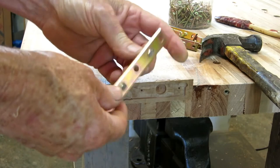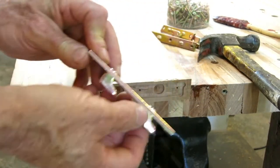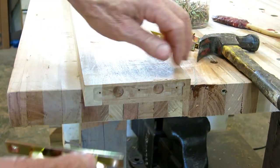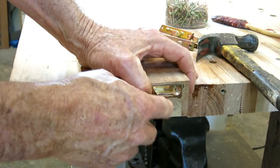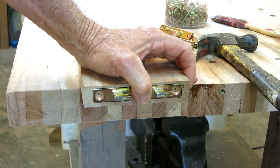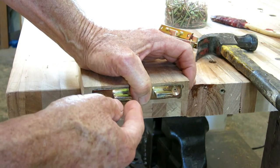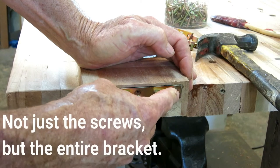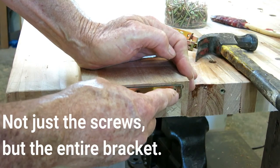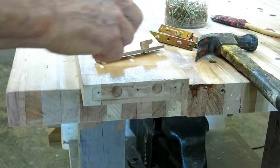The brackets go on the rails but the back of the rivet was proud, so I had to drill two shallow holes and now they fit okay. These screws are going into end grain, which I don't like at all. I'm going to get them all to fit and put all the screws in, then take them off and set them in epoxy. Because a little boy in this bed — man, this thing is going to see some bouncing — and that ought to hopefully make it Willie-proof.